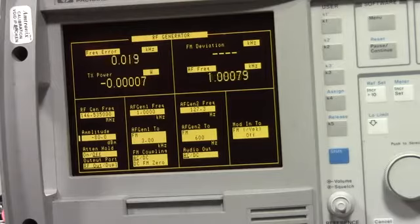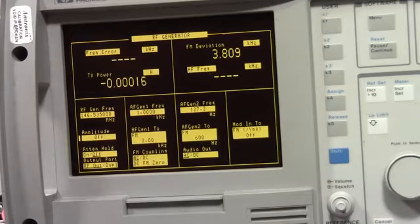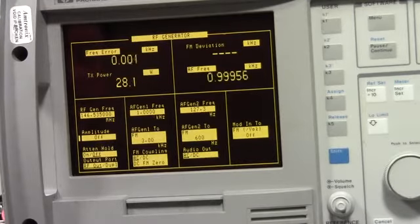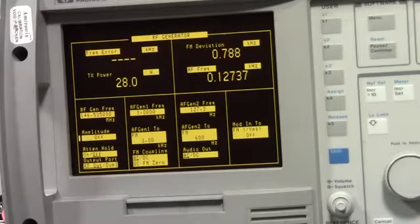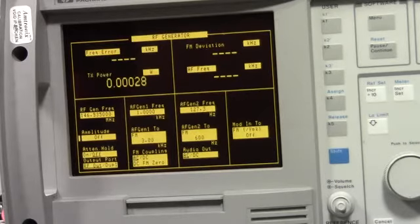Key up the service monitor, and then unkey it, and the SR1 will come back. Now you can see we're over-modulating, right? So we've now gotten above 3 kilohertz. So now what we can do is start running the #11 command to set the TX level to try and dial in just at 3 kilohertz. So it starts at 99. We can't go any higher, and so let's pick 80. So what I sent there was #1180 to set the transmit level at 80%.